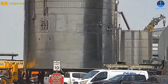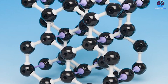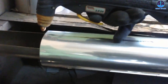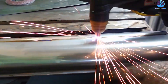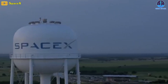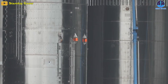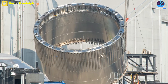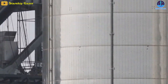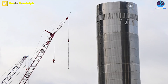There's also one more advantage of 304L steel over both 301 and 304, related to its low carbon content. When heated to high temperatures — for instance by welding — the chrome and carbon react to form areas that are more susceptible to both cracks and corrosion. SpaceX's motivation behind the switch from 301 to 304L stainless steel seems to be all about welding. Even though 304L itself is weaker, its welds at cryogenic temperatures are much stronger and much less prone to corrosion. This switch should allow SpaceX to keep the welds of Starship as they are when finished, without any complicated, expensive, or even impossible after-treatment.